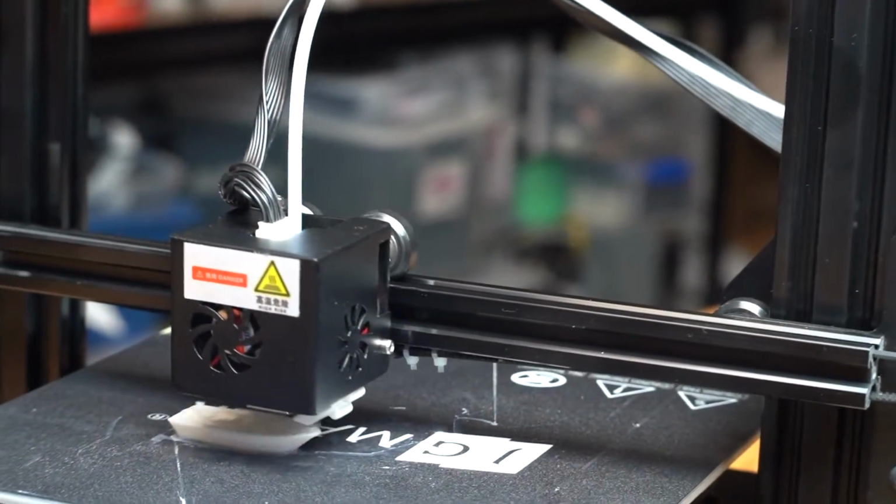The extruder on this printer uses a Bowden system where the extruder motor is mounted separately and the filament is pushed down a tube into the hot end. By having the extruder mounted separately, that makes the mass of the moving print head significantly lighter, and this can result in better quality printing at high speeds. However, if this filament tube is too long, you start to get side effects such as filament oozing or having to do significant compensation such as large retraction values. I'm happy to report that this is actually a really nice and short Bowden system, and it translates to really good print results.